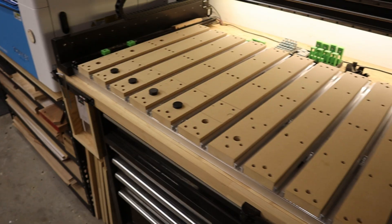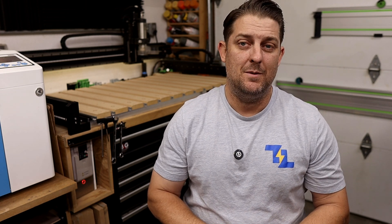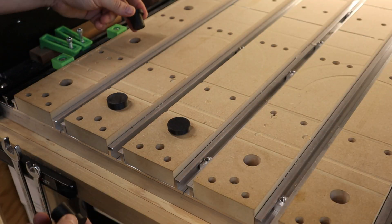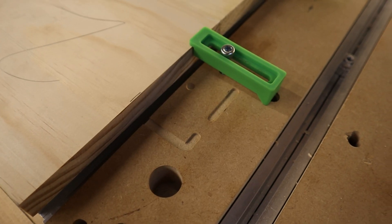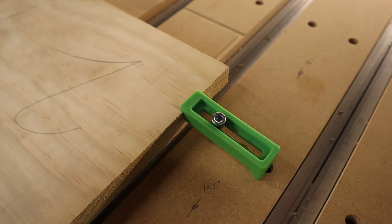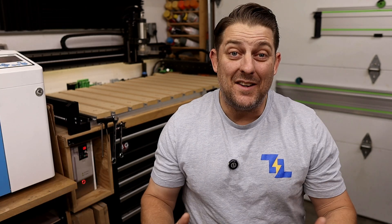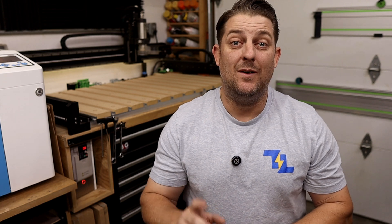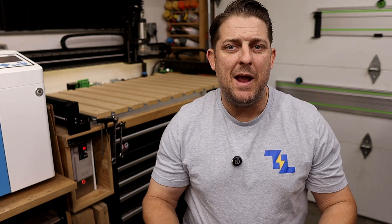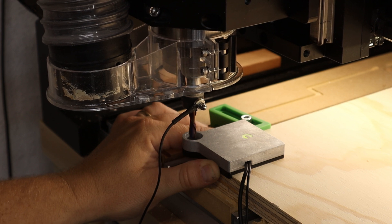Making your own clamps or hold-downs is another great beginner CNC project. You may also notice my upgraded spoilboard setup — this is a product I produce right here in the garage on this CNC and sell on my Etsy shop. The beauty of this spoilboard is that it combines a removable dog-hole fence for repeatable zeroing, 120 threaded inserts for additional clamping, and it's made from 1-inch MDF so it can be resurfaced more times than the stock three-quarter-inch spoilboard. Check out the video linked here, and I'll leave a link to my Etsy shop in the description below. Next, double-check you have the correct tool inserted into your collet and it's locked in tight. Now you can set up your X, Y, and Z zero points — you can do this manually or by using a touch probe.